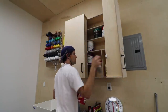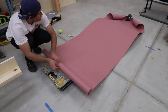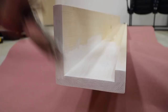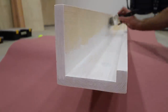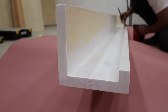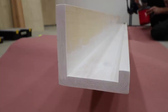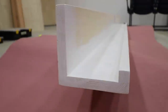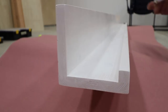It was really easy finding all my paint supplies because it was all organized in this new cabinet. I rolled out some paper and got to work. I decided to hand brush the entire thing because it would be hard to roll the inside corners. I did two passes with one brush, let that dry for a few hours, then came back and did another solid coat. The important thing is to make sure the knots can't be seen through the paint. A darker color may require less paint because the knots disappear easily, but this semi-gloss white paint just required a bit more painting. I didn't paint the back because it'll be hidden against the wall.